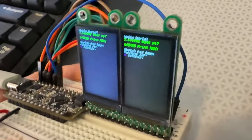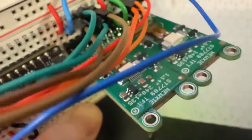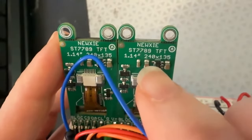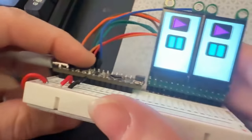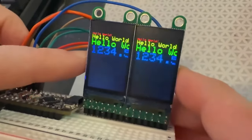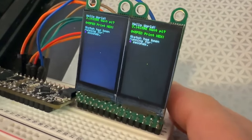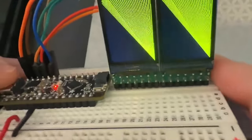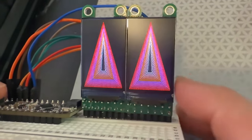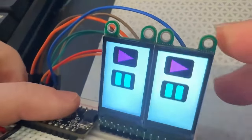We're waiting to finish brining the turkey — it's early Thanksgiving morning. I'm also testing out these Nuxi boards I designed that let you have vertical displays. This is a 1.14-inch 240×135 IPS TFT display, but it's vertical, and there are two of them stacked side by side so you can have as many as you want. You could have six in a row and have a cute flip-dot or flip display, like those things they used to have at train stations.